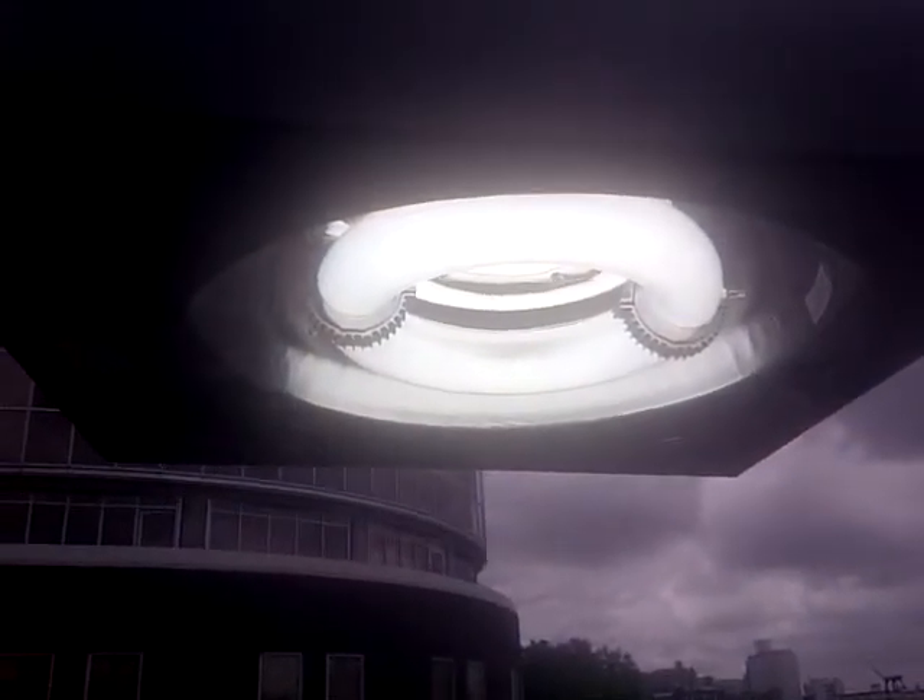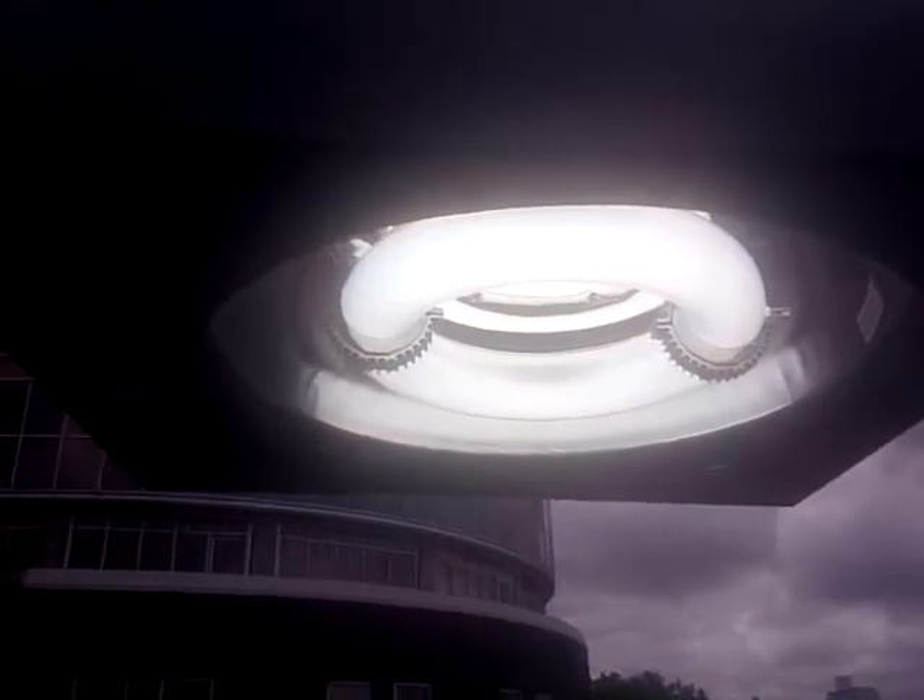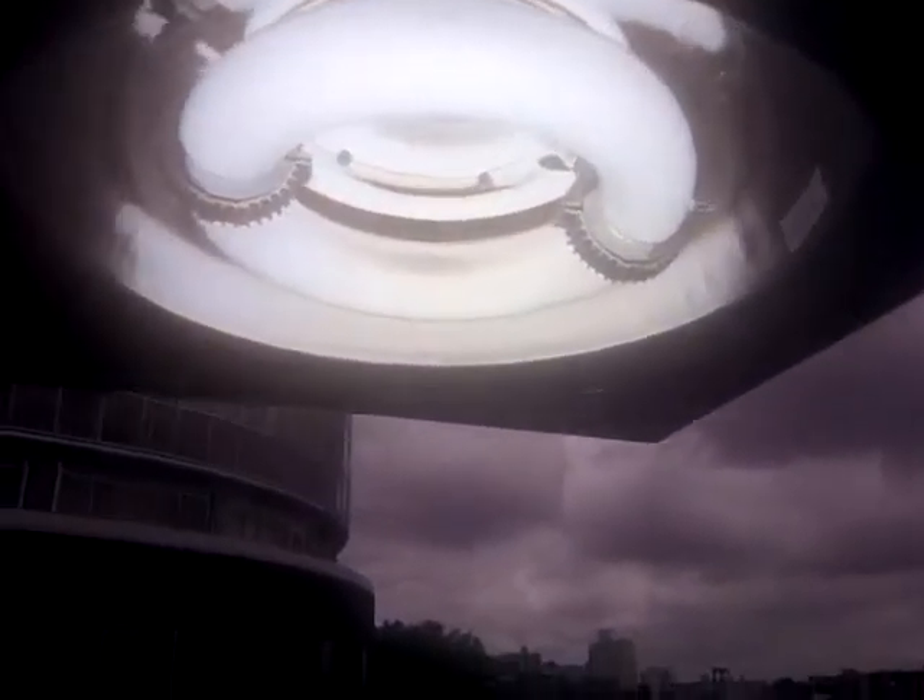The strike time here is about instantaneous, but it warms up in about 30 seconds. So you basically got instant light versus a gas lamp. The induction bulb here uses 100 watts less — this is a 150-watt induction bulb versus a 250-watt metal halide bulb. And it's a 100,000-hour lifetime on this.